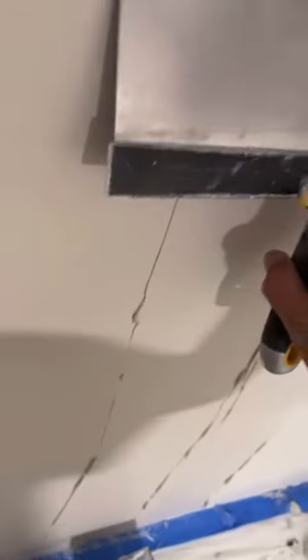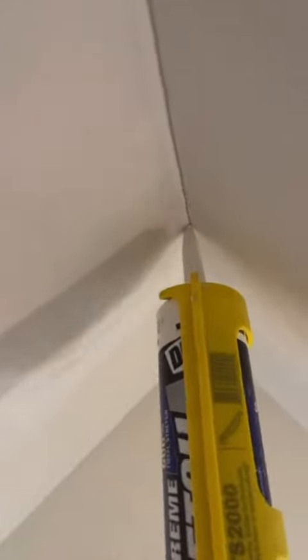You'll also want to feel where all the screws were at. I only recommend approaching this repair like this when it's minor water damage. If it's major water damage, then you would obviously remove the drywall entirely. But like I said, it was super minor. Now I'm just going to use my 12-inch to make sure everything's nice and smooth — I'm not leaving too much mud on the drywall so it's not going to be bumpy and I don't have to do a lot of sanding.